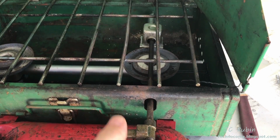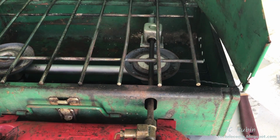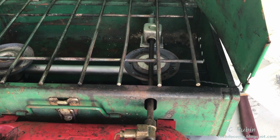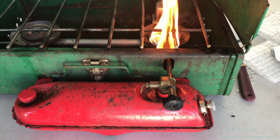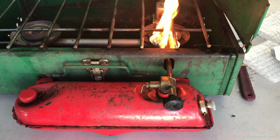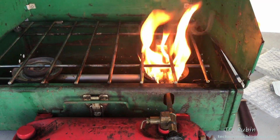So the vapor does not ignite with kerosene as I expected. You could just see clouds of it coming up. This is going to be preheated before this will work. There's just a little fire going in some tin foil with a little paper towel. This is just to heat up the bar. Let this run for a minute or so till the generator heats up.